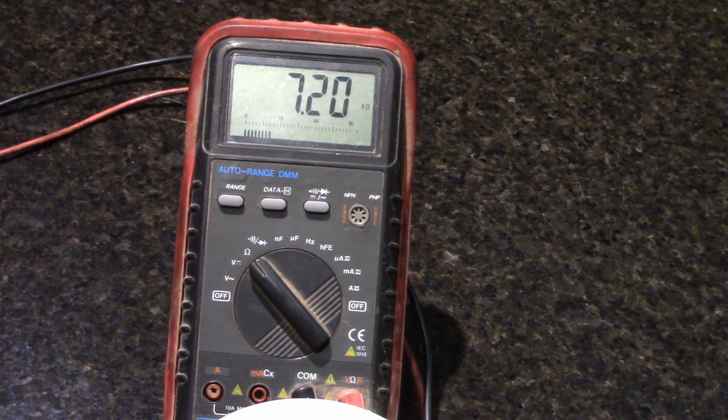And so then what I'm going to do is go out to the camper, and go ahead and disconnect the probe. I'll probably turn the refrigerator off, disconnect the probe from inside and outside, put a cup of water with ice in there, and do the same exact thing with the old one, and see what it reads freezing in this manner, like I have it right now. The probe is in the water, okay? We'll do it the same way.